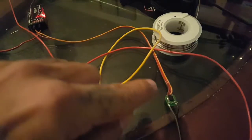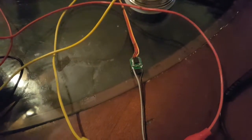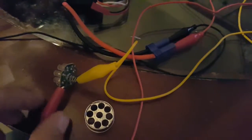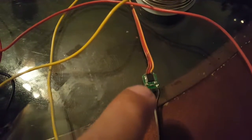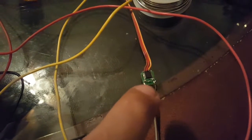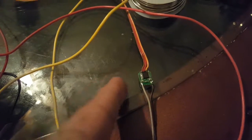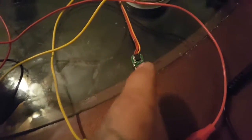I've got my servo switch plugged into the receiver on a dedicated channel. I have my jumper cables running along to a 5 volt flashlight that I took apart, which works well for demonstration purposes. Look close — I've got the three jumpers that went out to the rheostat soldered together, so the servo chipboard thinks the rheostat is centered. I've also soldered on the two extra lead wires that would have been for the motor.